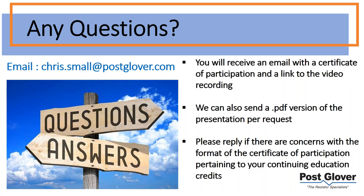What about the use of, say, surge arrestors? Well, that's going to increase the capacitance on your system. Depending on what that looks like, for example, if it's a high resistance ground system, that may be a problem in terms of the capacitive charge current. So you may not be able to use it that way. Any suggestions on, say, a connection scheme for surge arrestors? Should I connect them phase to ground?